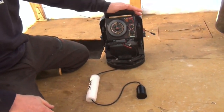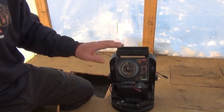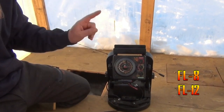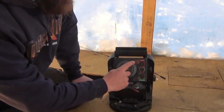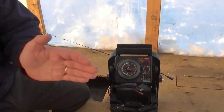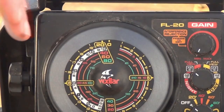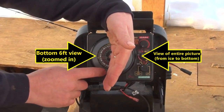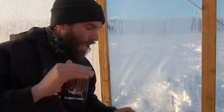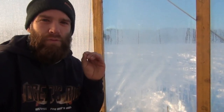So I've got a 12 degree and this is an FL-20. If you're going to buy one of these — FL-8s and FL-12s are amazing devices but have one huge weakness: they only give you a top to bottom reading. The FL-18, 20, 28 — all those have a top to bottom reading and then a bottom six-foot or bottom twelve-foot expanded view. Basically half the screen is showing you in detail what's happening at the bottom six feet. Huge deal. When you're trying to connect with a crappie or a perch and centimeters matter, you don't want to deal with the whole depth on a deep water — it's just too small for most people.